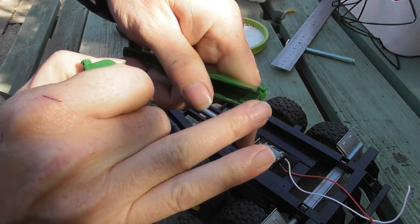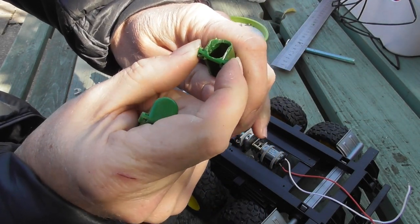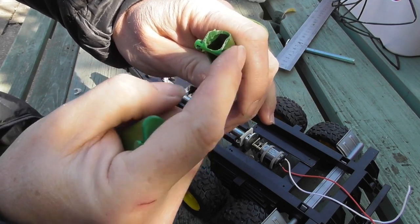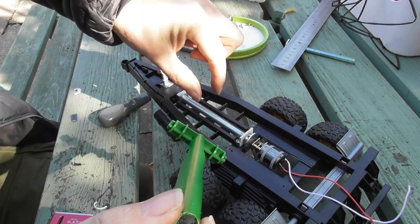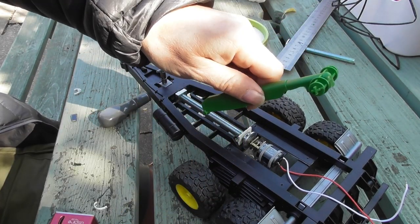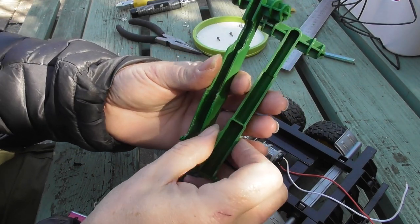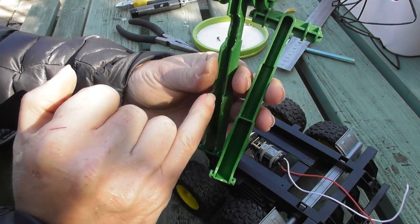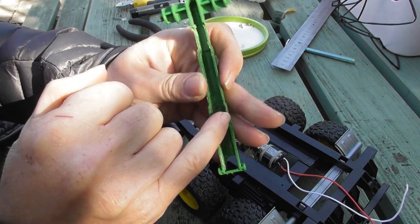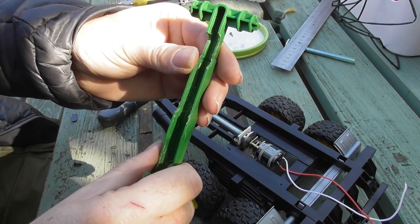And I've taken nearly everything out on this bottom bit, but I've left enough so that it's keeping these two parts apart, so that it still lodges underneath the rail there and doesn't try and come up. Underneath, I took out that bit there, and I actually slightly widened it until it wasn't fouling on the shaft.